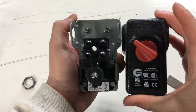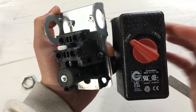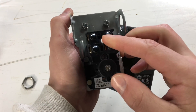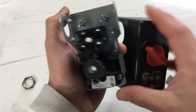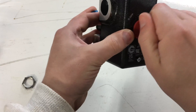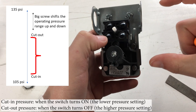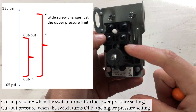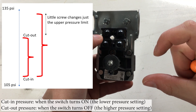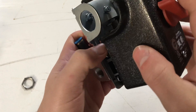This white post is connected to the off and auto switch. Auto is on, but it's automatically controlled off and on by the pressure switch. To align the two halves when putting it together, turn this counter-clockwise all the way, and the other one counter-clockwise all the way — that helps align the two together. By turning the main screw clockwise, it shifts the whole fixed range of pressures the compressor operates at. The other screw changes the upper cutout pressure, which effectively changes the range — the lower pressure doesn't change but the upper one does. Finally, the small opening is just the screw hole for mounting the cover.